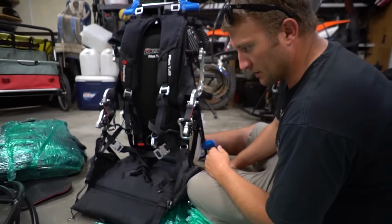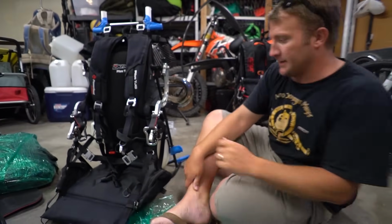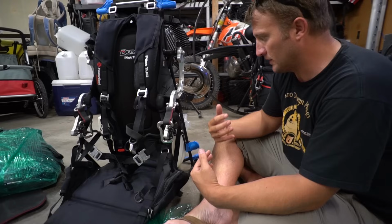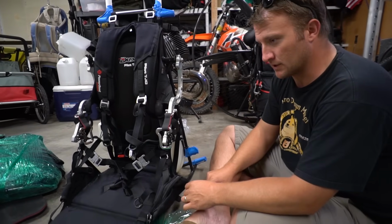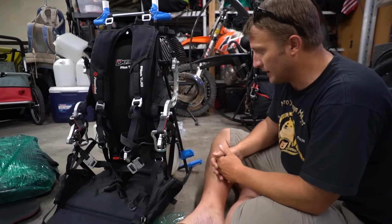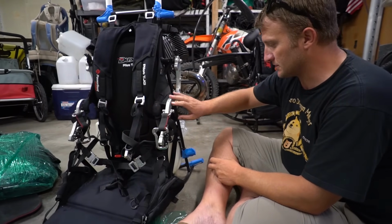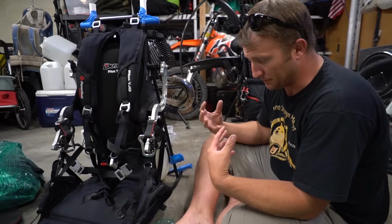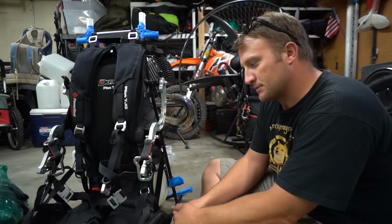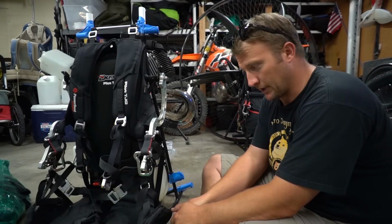There's a ton of designs out there from the late 80s about paramotor designs, but generally speaking, for me, the most important things are not so much strength of the cage, because training can make up for that. But I think strength of the suspension system, swing arm system, and geometry of the swing arm system. I personally don't like high hang points. I know a lot of people fly them and prefer them. There's paramotors out there from the early 90s that would not tolerate high Gs.